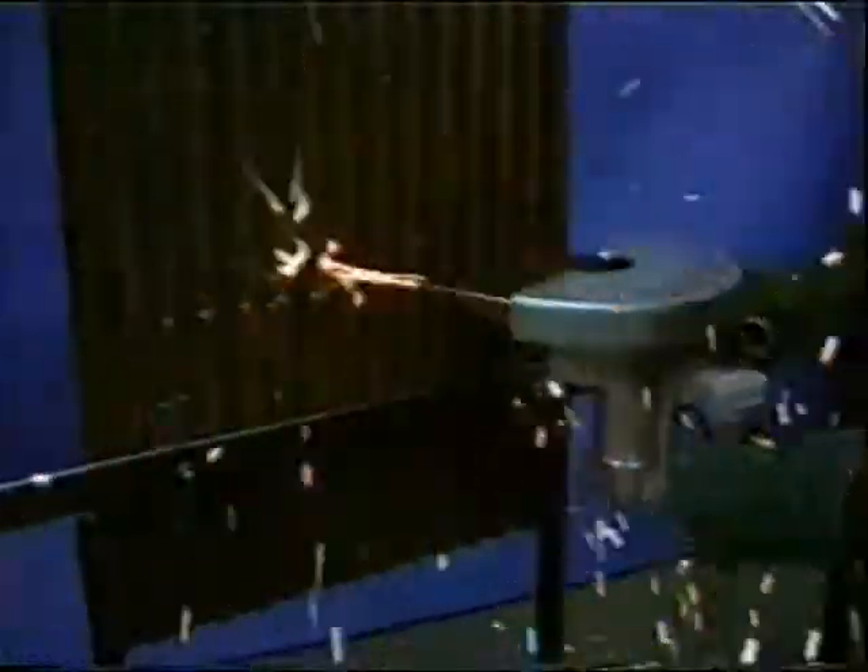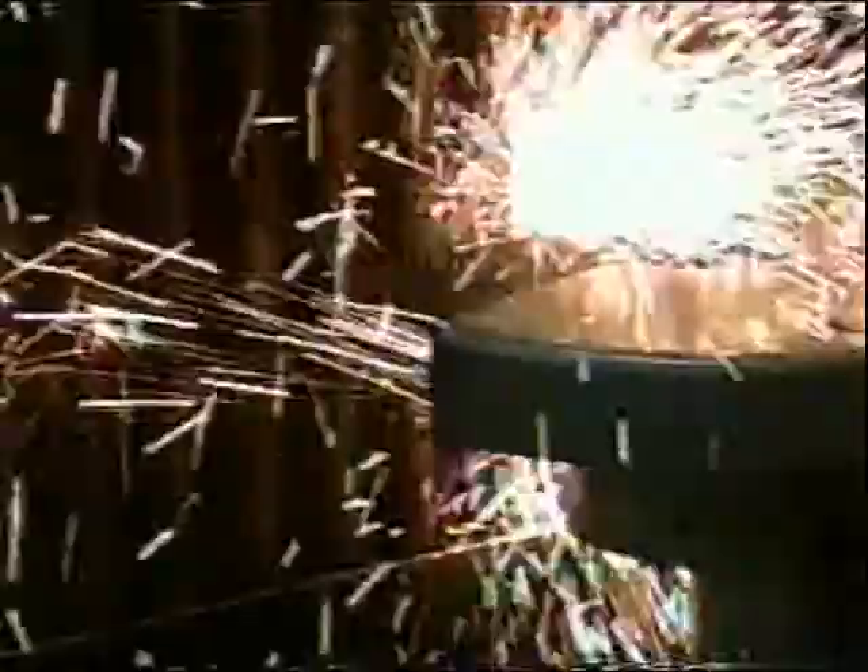Please notice the technique. Proper cutting requires the blade to be moved back and forth while plunging the saw into the tubes. By using this technique, the saw blade develops a cut path that helps ensure a smooth square cut. If the blade were simply plunged in and forced to cut as if through a piece of plywood, the blade deviates and is forced either up or down, creating an uneven cut.